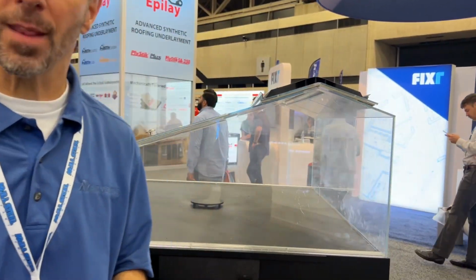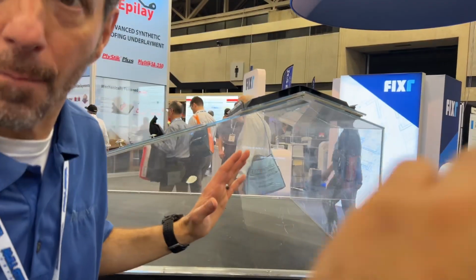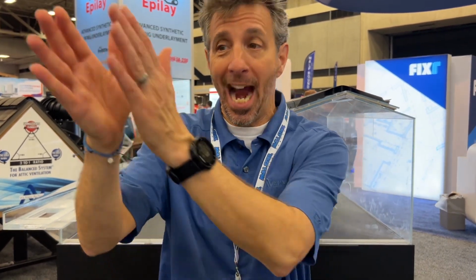And Paul, last question. Our customers have told us another roofer is telling them that they can put ridge vents on all peaks of the roof, and we tell them if the peak is too low, it's not going to work, because it's going to create a confused air system in the attic. Is that okay? So when you have one massive attic with multiple ridge heights, and the vertical distance between the ridge heights is greater than 3 feet, we recommend you either limit the exhaust to the uppermost ridge, or if that won't meet your attic's needs, try to isolate the attics by stapling in some plastic sheeting vertically, attic 1, attic 2, attic 3, and then you can exhaust all the peaks.